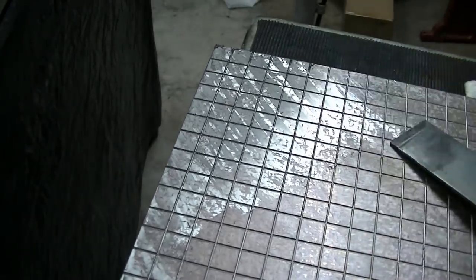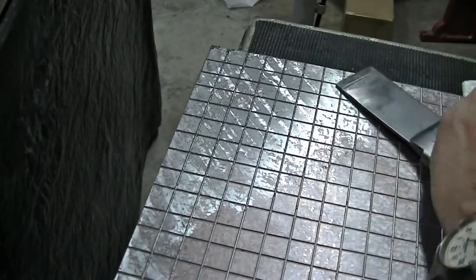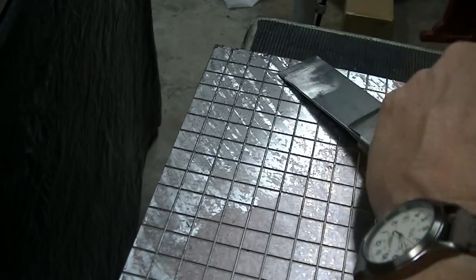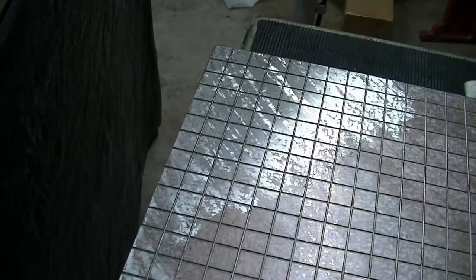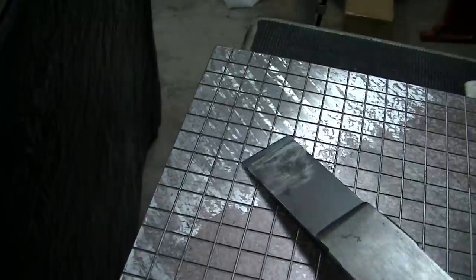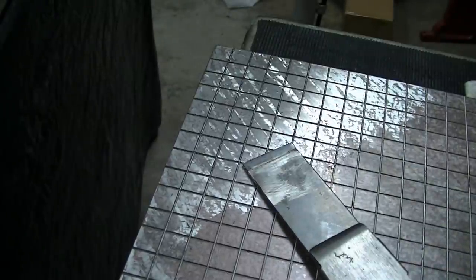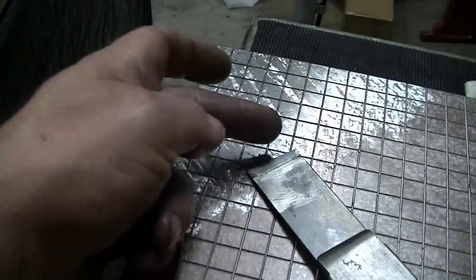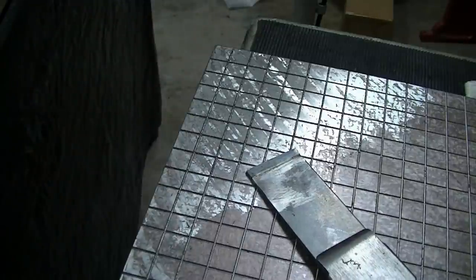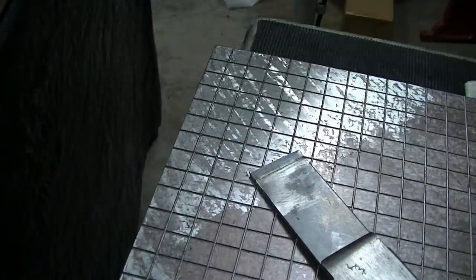See how this super wide scraper takes a very wide flat cut and keeps me out of trouble. Making sure these edges are good there. You never want to take a pass in the same direction twice because you're inviting chatter. By crossing, the long smooth edge of the scraper bridges the chatter from the other direction, and there's no good reason for having chatter in your scraping.